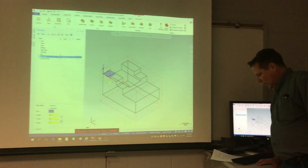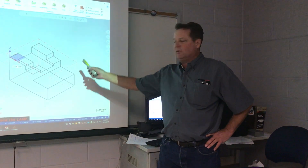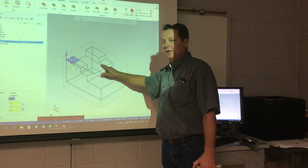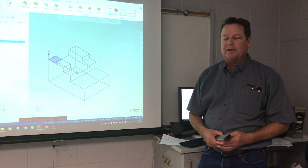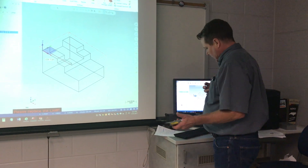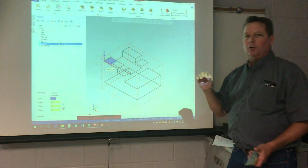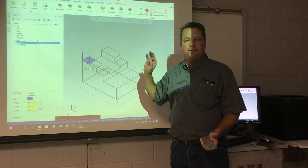Dynamic milling is only intended for roughing. I've left ten thousandths on all the surfaces and walls. I like the finish that dynamic milling leaves, so I have students finish the depths of the features but then they can finish the side walls at their leisure with a nice slow toolpath for a good finish. We're going to take a half-inch end mill, go down an inch and three-eighths all the way down the side of the part and cut all the way around, but stepping over only seven percent — so the radial depth of cut is only about thirty-five thousandths.